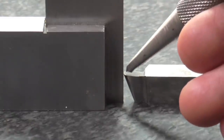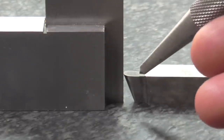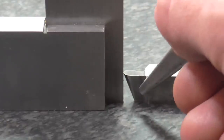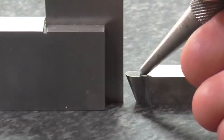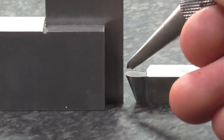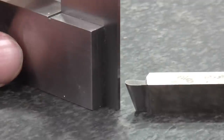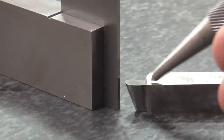My front rake is a bit excessive — the more rake you put on, the weaker you make the cutting edge. If you want to know exactly how much rake you should have, there are manuals and textbooks that tell you, but by and large the tougher the material the shallower the rake angle. For a really tough material like stainless steel you will be coming closer to vertical than, say, for plastic where it might be raked right back. You'll notice there's quite shallow top rake on here compared to the sides — as you put top rake on you effectively tip a surface and actually affect the geometry that you are presenting to the lathe. That's quite a complicated topic, but all you need to remember is: have a cutting edge and have all the surfaces sloping back from it.